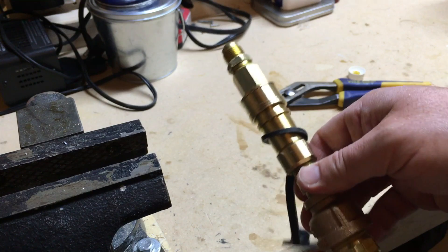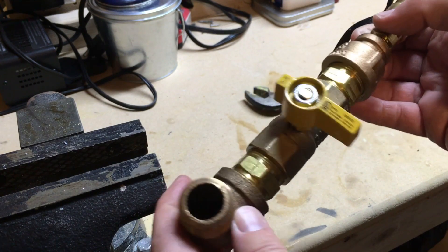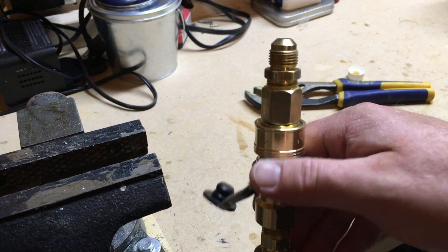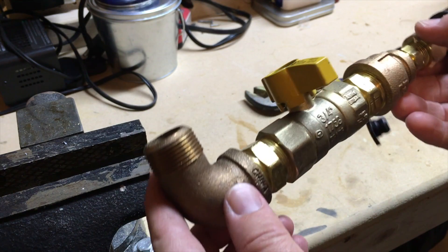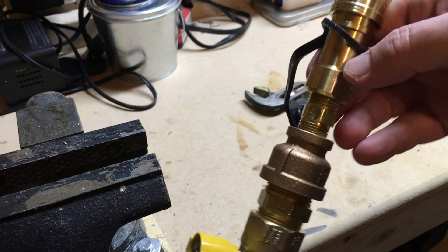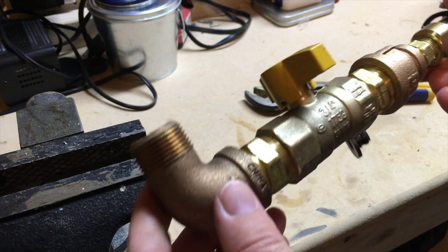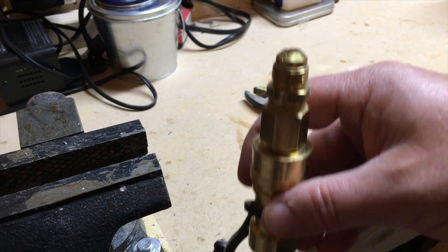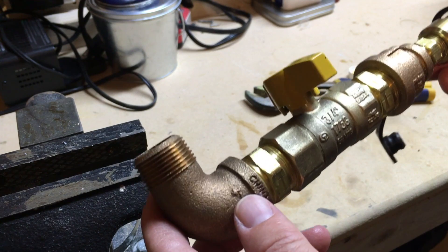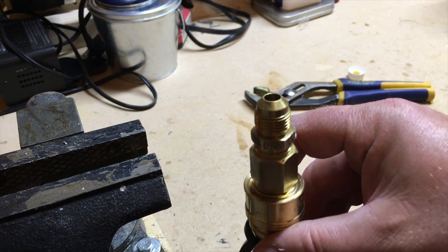Lastly, I just want to say that when you put something like this together, I really had to sit down, close my eyes, and visualize what I needed to make all these connections — to get from three-quarter inch to three-eighths flare and do it with a quick connect. Then I sat down on Amazon with it sketched out in my head and said: I need this adapter, then a coupler, then a reducer, then another coupler, then my disconnect, then go to my hose. Everything's done in sequence. I found it easier to do on Amazon because I could put it in my cart in sequence and get it from start to finish.